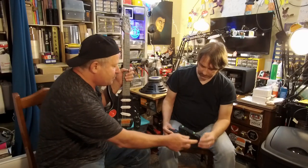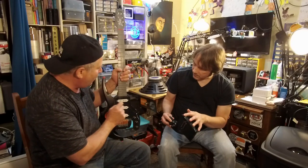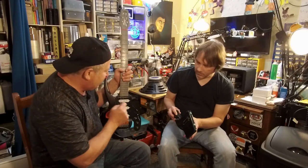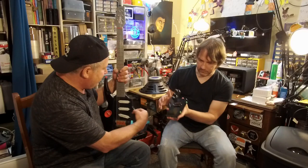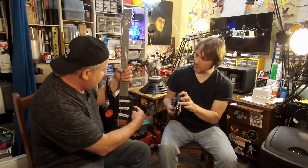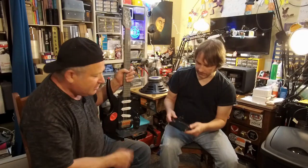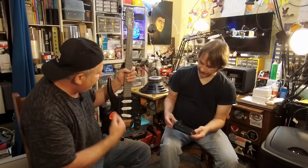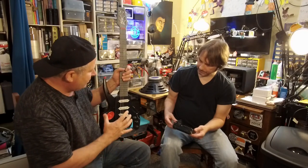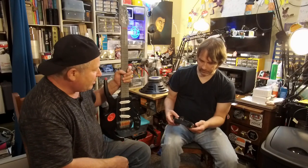We've got here two mushrooms made out of silicone rubber, and basically they squeeze in, but only on the last 1/8 of an inch. So when you click, it makes it open easy, because they push out. When you push in, just on the very last bit, it's locked. It's just enough to kick it out slightly. And you see there's no movement. It was very important for us that all those parts just snug together, because plastic is a very noisy material.